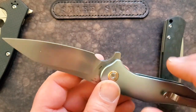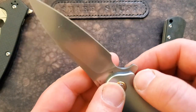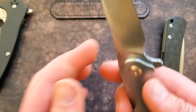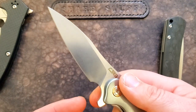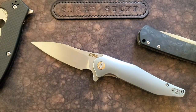So it's too big to be a sharpening choil and too small to be a finger choil. What I'm going to do is make this cutout a little bit larger. You can see there's quite a lot of space here — a good 3/32nds of an inch or so. If I remove that material, it won't change the way the flipper functions, but it will give me enough room for a finger up here, which is what I want.